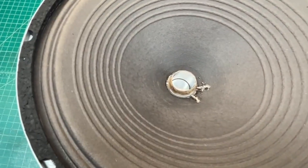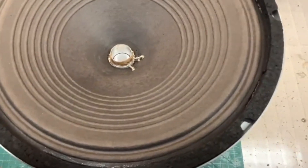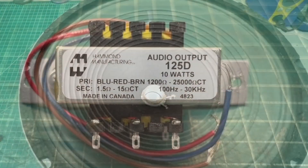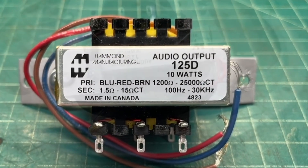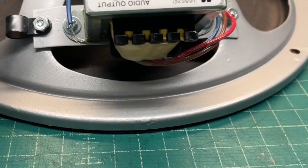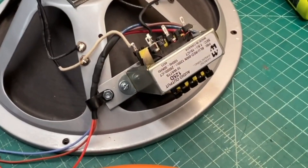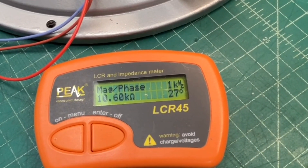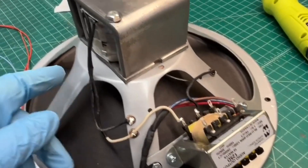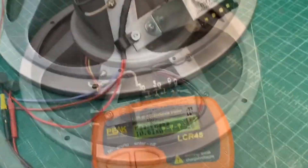Just finished placing epoxy on the outside of the voice coil back to the cone, and then sealed around the surround where it meets the gasket. Another Hammond 125D push-pull output transformer — it will handle the 10 watts for this particular receiver. The secondary itself is tapped, and you can see the tapping location I chose, looking at the impedance just above 10,000 ohms. That would be a great match for the 6F6 push-pull tube configuration.